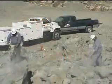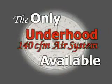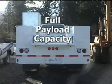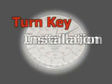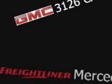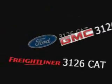The Underhood VR140 delivers more than enough air to run multiple tools at once. It permits better use of payload and workspace while adding only 220 pounds to the GVW. The VR140 is designed to fit the top North American medium and heavy duty trucks.